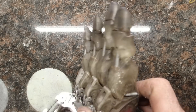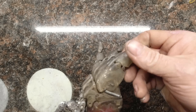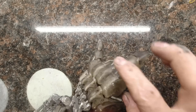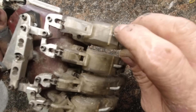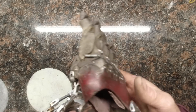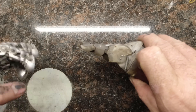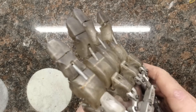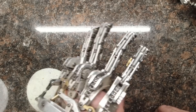On my last plastic hand that had printed fingers, I found that they had an average usable lifespan of about 3 weeks of daily use, then the hinge points would start to fail. The pinky and index were of course subject to a higher failure rate due to their proclivity to lateral impact. I would usually experience breakage of the MCP or PIP joints. I also noticed age-related failure due to UV exposure over time. That's where the aluminum fingers really come out on top.